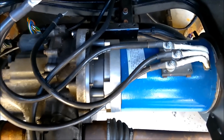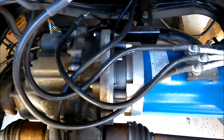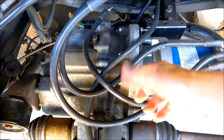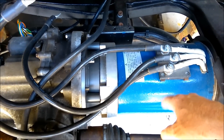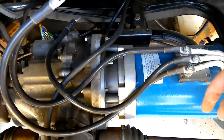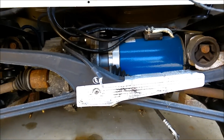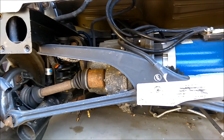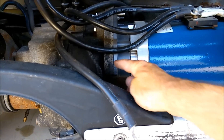I've had quite a bit of interest about the motor and gearbox I've used. The gearbox is the standard Smart gearbox with the auto selector on it and the brushless three-phase motor. What I'm going to do is take them out to put this switch in and put the cabling in - it seems like a good excuse and a last chance really to drop this out of the car. There's only four bolts that hold it in so it's really easy to do. I'll take it apart and show exactly what I've done and how I've connected the motor onto the gearbox.